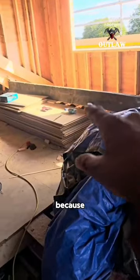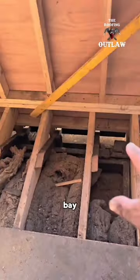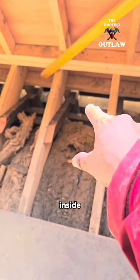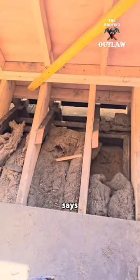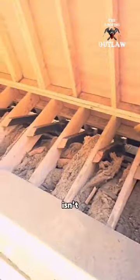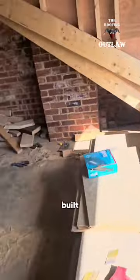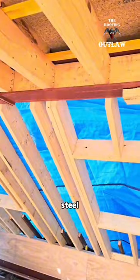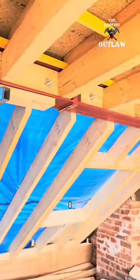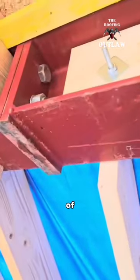This timber here is left in because we're actually going to use that timber, because the dormer here is built over the top of the bay window. So we have to drop the ceiling inside and double that beam up there, because the structural engineer says that a 9x3 beam spanning 3 metres isn't strong enough to have this dormer built on it, even though I have built hundreds of dormers off 9x3. Now we have to have steel and other things, and some of these buildings I work on, 200 years old, built off 9x3s, still there. But yet we need to use a piece of steel. Look at it. See you later.